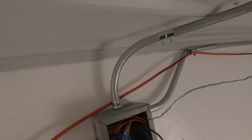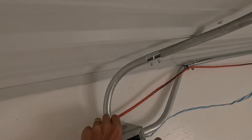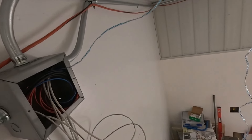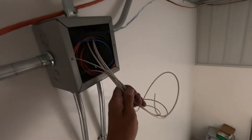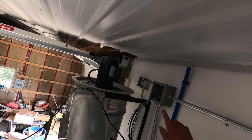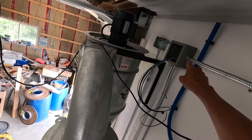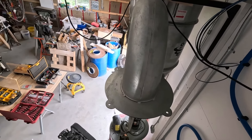I'll probably leave this loop in the box. Cut this neutral, and that's about it. Now two of those wires have to go all the way to that far box, and a couple wires have to go to that near box. There are some splices in here, and we've got wires going all the way to the bottom and wires going to that box right there.